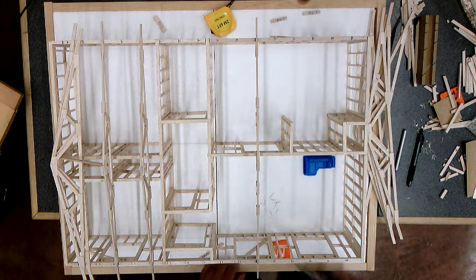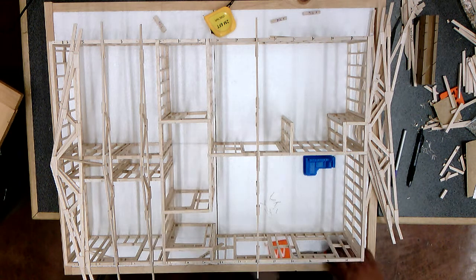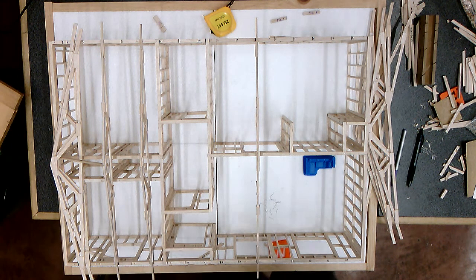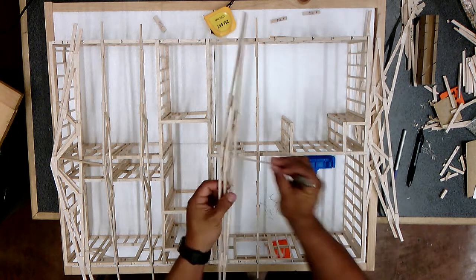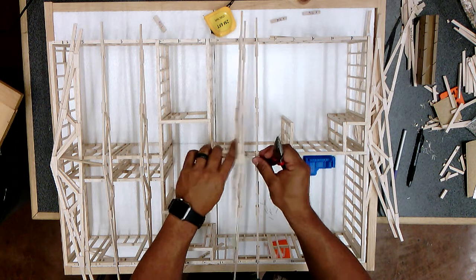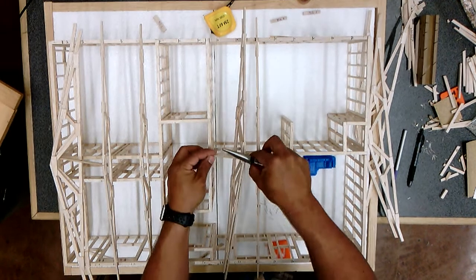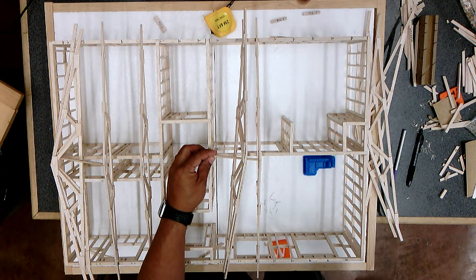Okay, that one's in. And then the sway brace would go this direction, so let's toenail this in. But toenailing it is going to mean that we have to have two on it. So I'll put these two, leave this inside, and then stand them up. Flip them up like that, and you shouldn't have a problem. I dropped my nail, getting another nail.